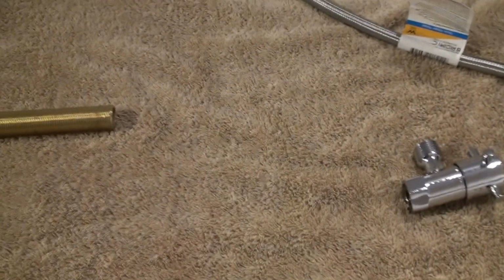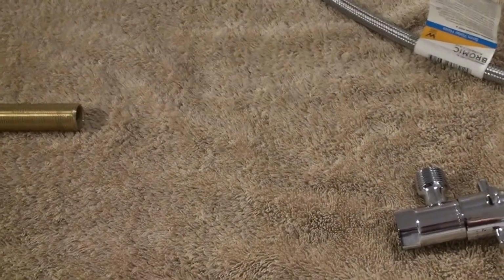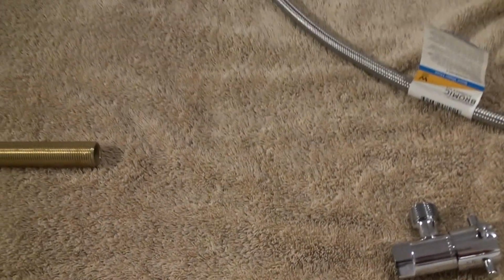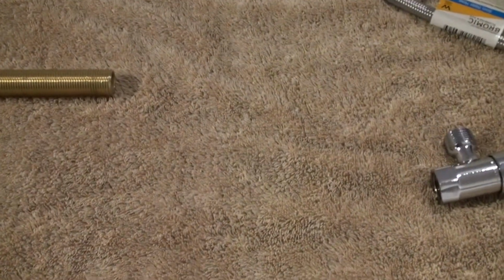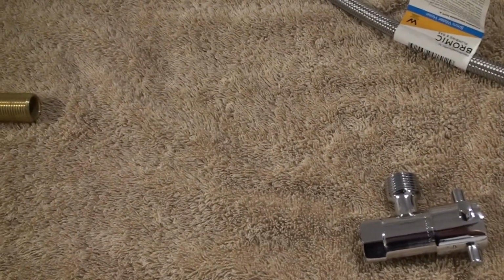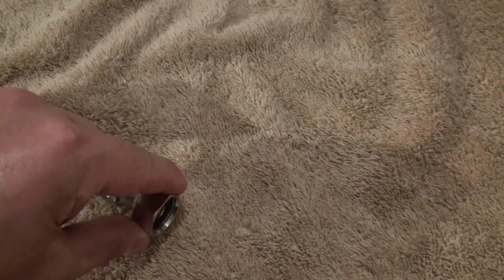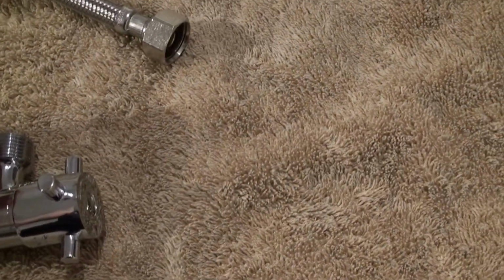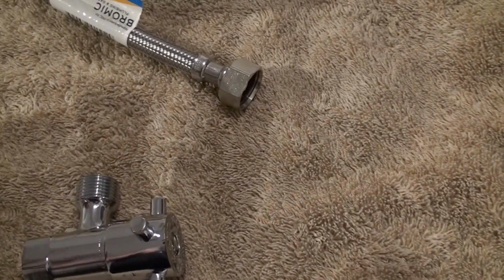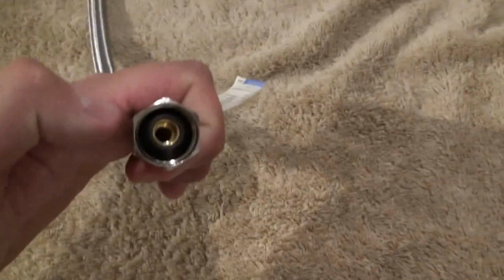So that's the way we, as plumbers from Mayfair Plumbing and Gasfitting in Adelaide, install flexible water hoses. There is no need for the Teflon tape, which we quite often see, and look, I'm sure it doesn't do any harm, but it would make getting this nut done up a lot more challenging because the thread has resistance on it. So make your life easier, eliminate the Teflon tape off of these threads, and just use the flexi hose's rubber seal the way it's designed to be installed.